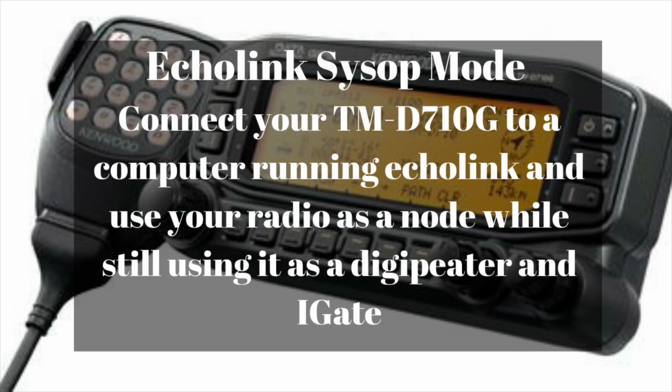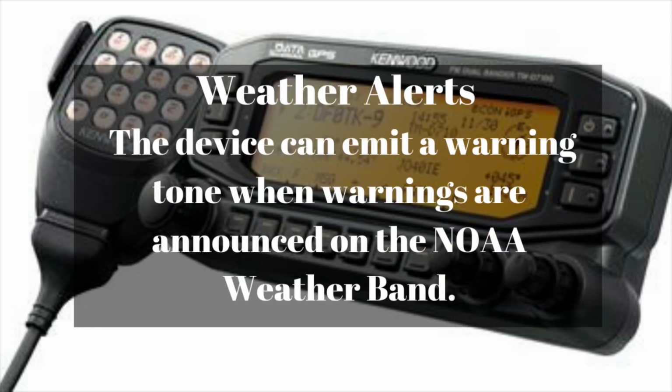There is an EchoLink Sysop mode, in which you can connect this radio to a computer that has EchoLink running, and you can use it as an EchoLink node to talk onto the EchoLink system. And you can do this all at the same time while you're using it as a digipeater and an IGate. So all three functions can be used at the same time, which again is really neat. You can receive weather alerts. This device will emit a warning tone whenever a severe weather alert comes out. And it doesn't have to be on the weather channel. It'll actually scan those frequencies every so often to get those alerts.